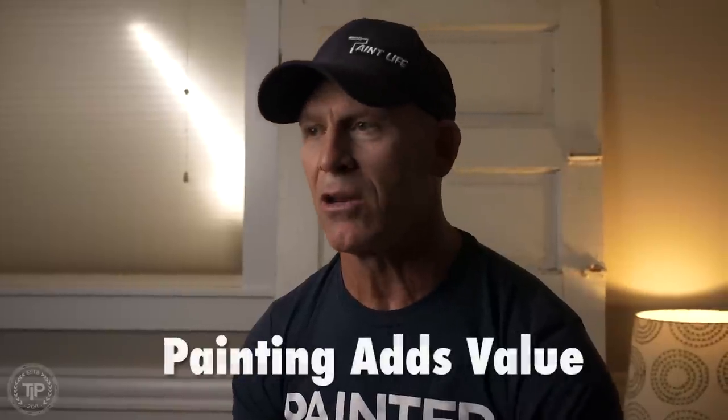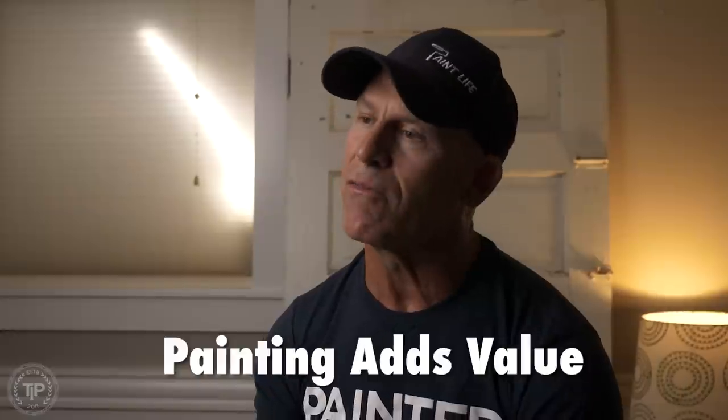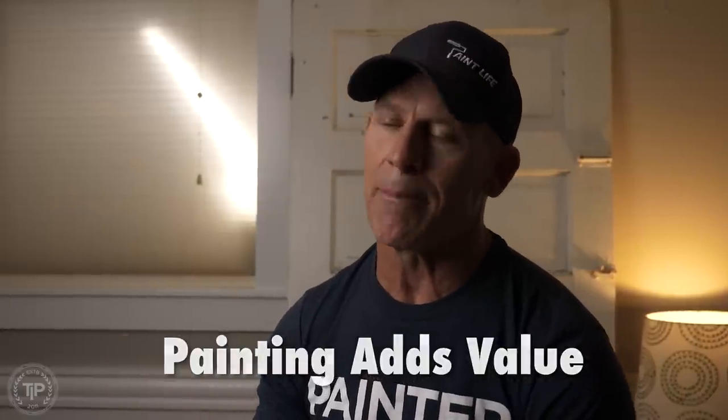But you can paint it. When it comes to the painting process, painting your house increases the value of your house. So you do want to paint it. Vinyl degrades over time — it gets chalky, it fades — so you do want to paint it and give it a fresh look. So let's talk about the painting process and how we go about painting it. We're going to also talk about colors, because you are limited to a certain extent in what colors you can paint your house.